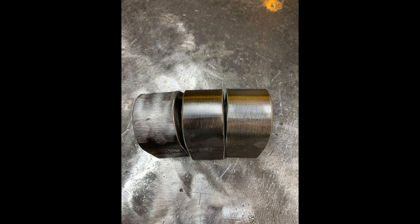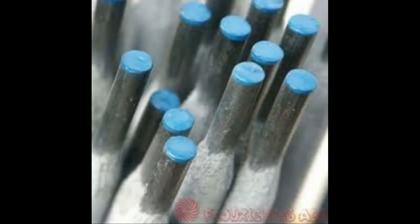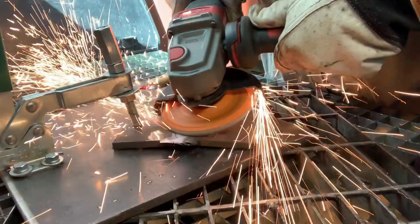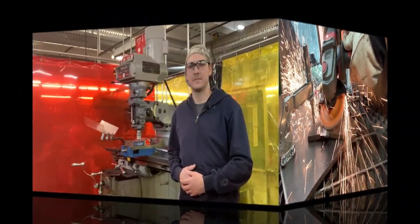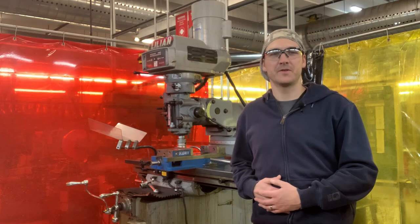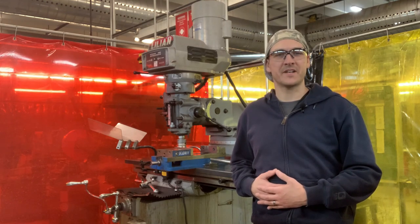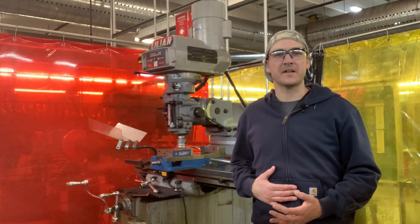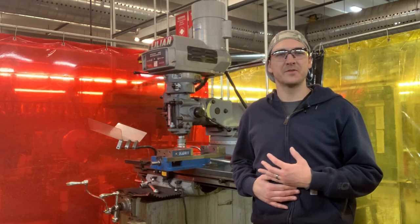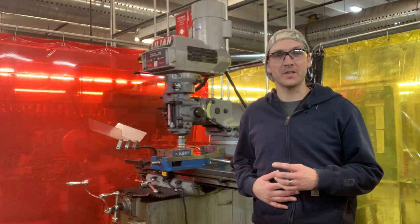All materials including electrodes and coupons are supplied by the test center. Electrodes must be a low-hydrogen 7018, 1/8 of an inch or larger in diameter. No grinders, saw blades, files, or methods that remove deposited metal or alter weld bead profile are permitted. That's your S-class ticket in the flat position with SMAW. I really hope you learned something today. One last thing — be nice to your welding inspector, listen to him, and don't argue; he's the one who's going to sign off on your test plate. Like always, keep your lenses clean and be safe.